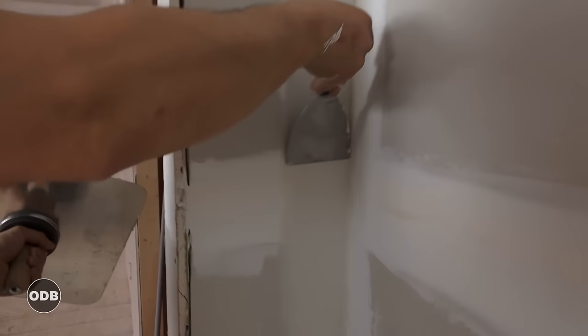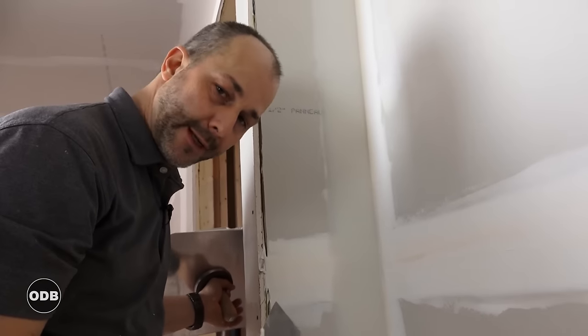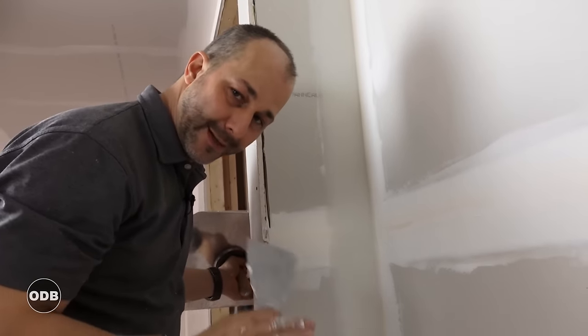I'm not making the other side of that corner dirty. As soon as I see a little excess mud, I'll take it out, hit the trough again, clean my knife. I'll start coming from the other direction — always finishing to finish mud. Second day, first coat on your inside corners — only do one side.